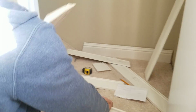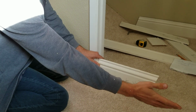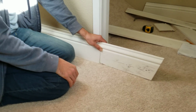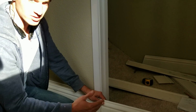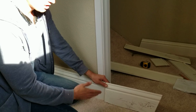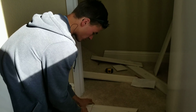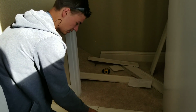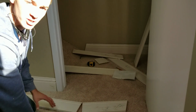Now, like I told you earlier, 180 degrees is a straight line. So if I do two regular cuts on the miter saw at 0, two 90-degree cuts, 90 plus 90 makes 180 straight, right? And on the miter saw, you guys all know, for me to make this cut right here, that's at 0. That's just miter saw set at 0. If I start switching it, and I cut my baseboards flat in this case. So the miter saw being at 0, I make the cut, boom, I got 180 degrees.